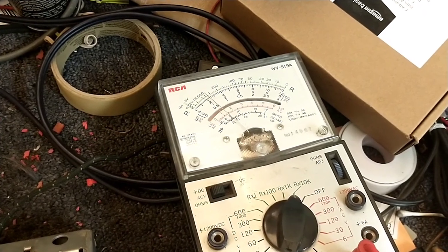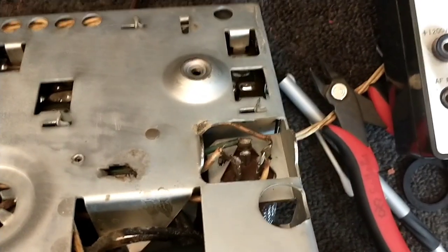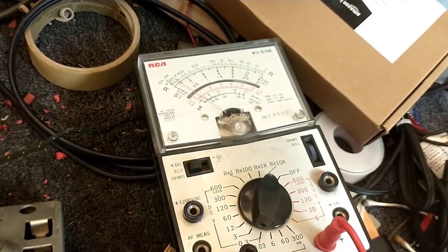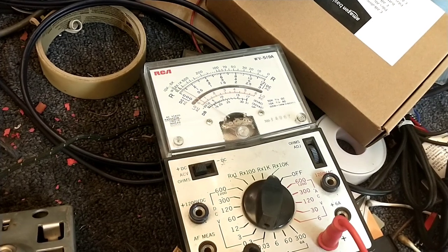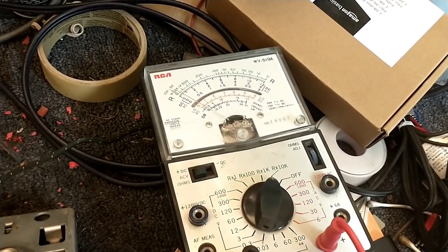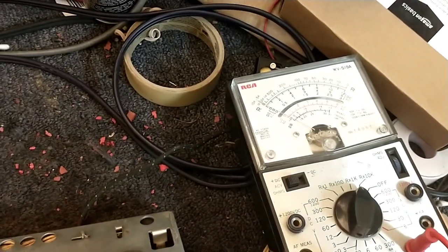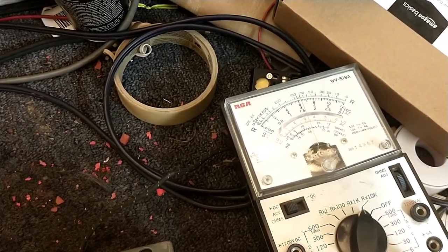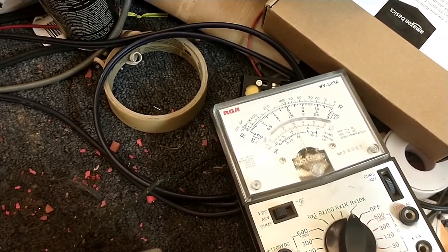We've got a 10 at 450 here for comparison. You can see how quickly that charges — up and up and up, all the way to infinity. So that capacitor is definitely leaky. It just keeps going up, doesn't slow down, doesn't stall. If I had a cap checker that put out 400 volts, I'm sure it would fail miserably. This is why it's a good idea to recap these high-voltage things, kids — the ESR meter says it's good, but trying to charge it against the new one, you can see the old one probably still isn't charged. It starts to stall out at 100. It's leaky. It's defective.